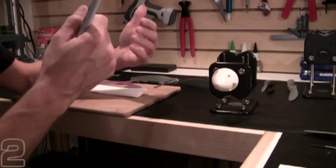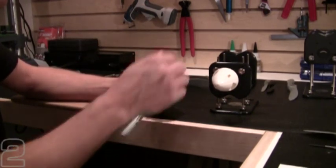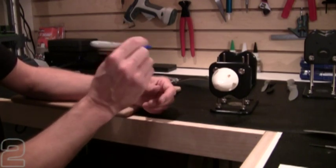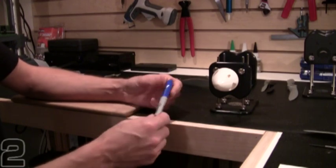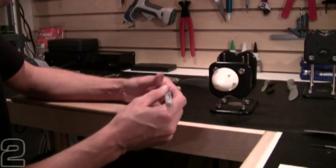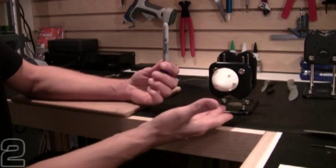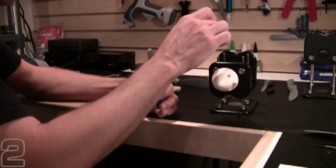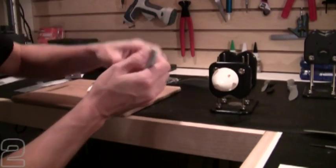On your plastic spinner or your aluminum spinner, you can use a sharpie marker — it usually comes off very easily. You can test it on the back side if you're worried; put a small dot on and see if it comes off with some rubbing alcohol. 70% rubbing alcohol will usually take a sharpie marker off most materials. I'm going to mark the high point because I want to add weight to it, so I don't want to mark the heavy side or the low point. I want to mark not just the back plate but also the spinner cone, so when I reassemble it I know I'm putting it back together the way it was tested.